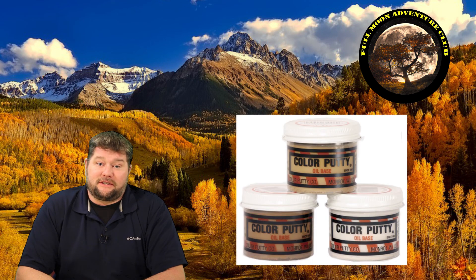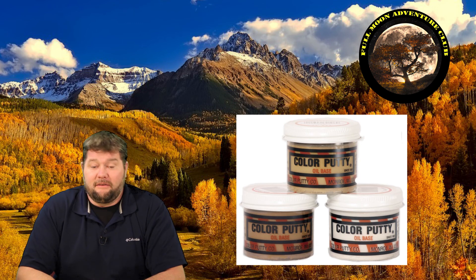I'm definitely liking it — I think it turned out pretty well. Slept in there a couple of nights and I'm definitely liking the way it looks. The color putty I used to fill in some of the gaps and cracks is called exactly that — color putty. You can get it at Home Depot or anywhere else and it matches just about any color of wood you can imagine. Take a piece of whatever you're trying to match to compare the color — it works really well, and I've been using that same jar for about a year now and it hasn't dried out. For anybody curious about the reflective blinds I put in, I will do a video on that to let you know how I'm liking that little upgrade.